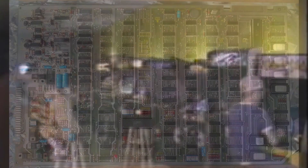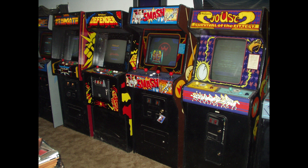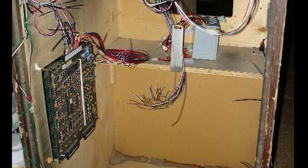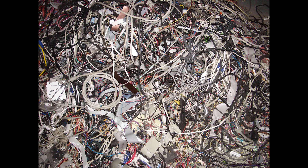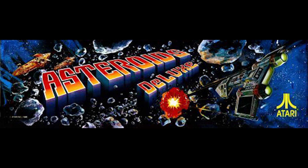In the early 80s, most arcade PCBs, harnesses, and power supplies were custom-built. When an old game became unprofitable or a new game wasn't making money, arcade operators would typically seek to replace the cabinet. The operator had two options: haul the cabinet away and get a replacement — an expensive process taking weeks or even months — or rewire the cabinet and update the artwork to put different games into it. The second was preferred, but rewiring PCBs and replacing marquee artwork was still very time-consuming. This is where the JAMMA wiring standard comes in.